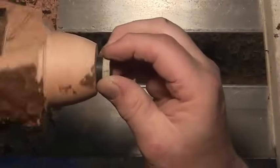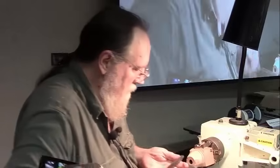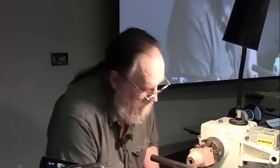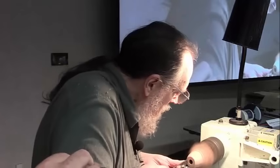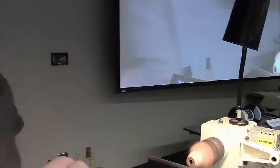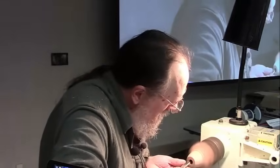The next operation — remember I left a little shoulder here. The thing I forgot was a little square-in cutter, so we'll use a borrowed cutoff tool. Doing what I just did disrupted the front of that thread, so I have to cut a chamfer now; otherwise that will never get a true fit. Put the chamfer back in.